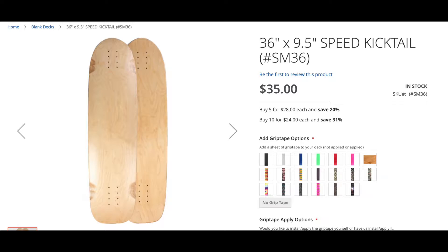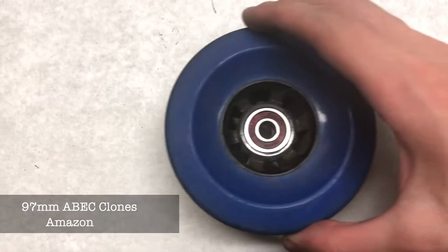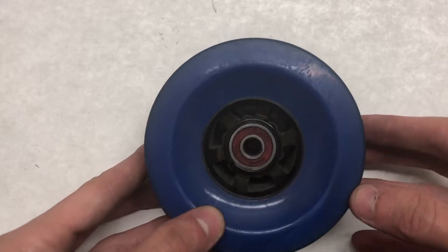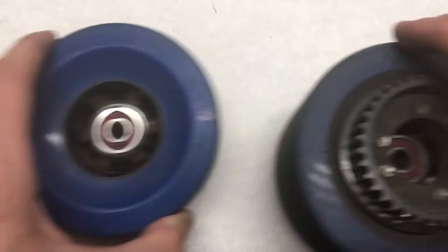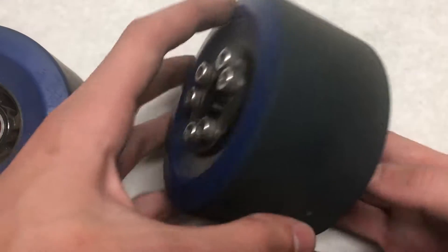We will be using the 97mm ABEC flywheel clone wheels from Amazon. We chose the 97mm wheels because they're larger and will make the ride much smoother. We have the wheel pulley already installed — it's a 12mm wide pulley from DIY Electric Skateboard for ABEC wheels.